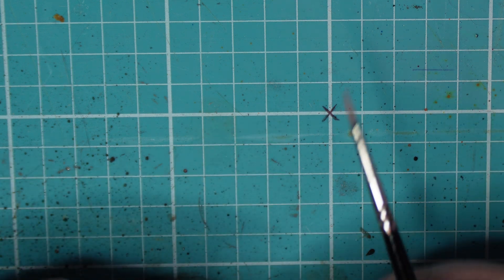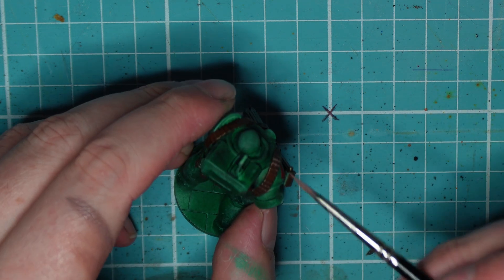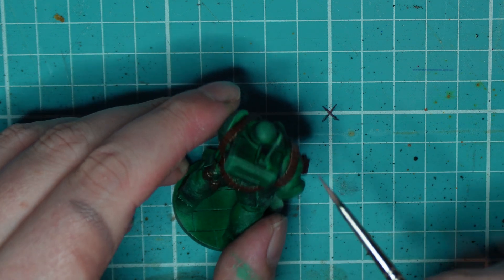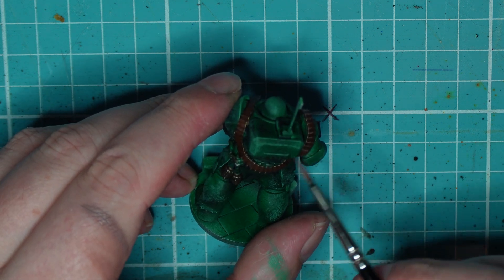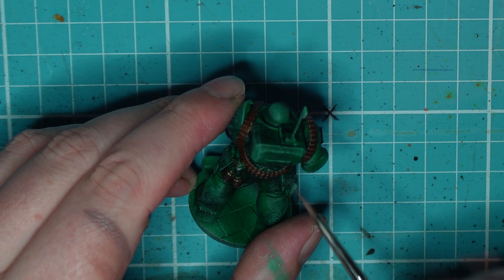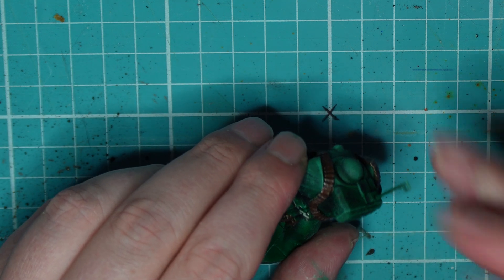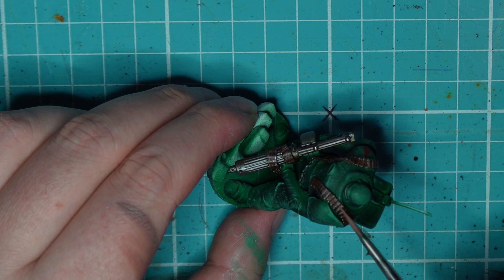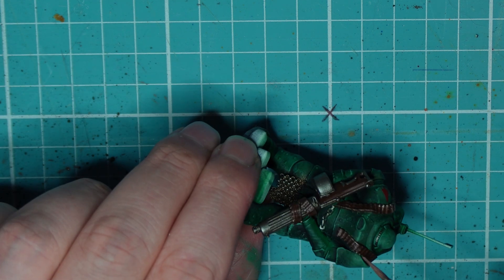You turn it on, it runs some self-checks, and you're good to go. It'll tell you anything that is amiss so you can resolve it without major issue. You pour some resin into the vat — stay below the max line — the USB key goes in, you take your design from the USB key and you print it. It's pretty easy. They include Chitubox Basic and a key for Pro, and on the actual machine it's very funky — I've got like 93 days of Pro or something like that.